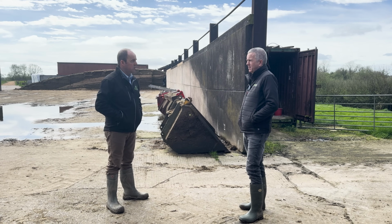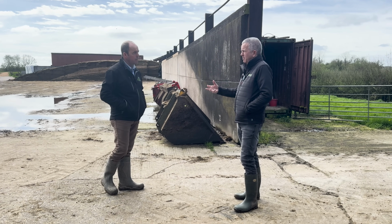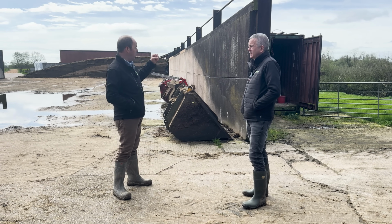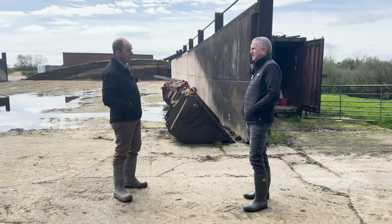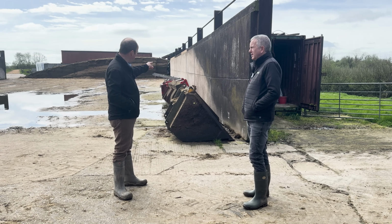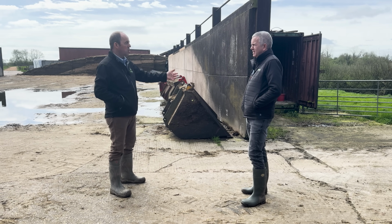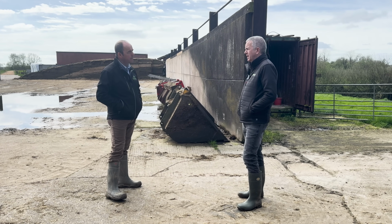So planning. So there are maybe some additives or things that you can buy that will buy you some time in a way. Yeah, that you can put on the surface. Yeah. There are also treatments. There are several companies in the UK that manufacture products for repairing silage pits and for putting treatments, hardeners, onto the concrete. They even make products that you can put onto silage pit walls. So if you've got some crumbling or stone crumbling, there are resins that you can apply. Yeah. But that's not something you'd want to rely on. It's to try and get you out of a sticky situation.